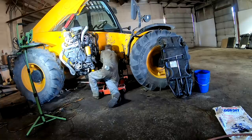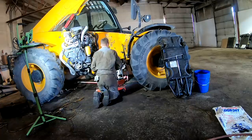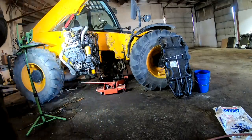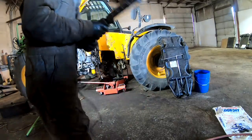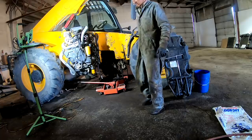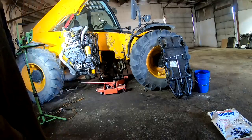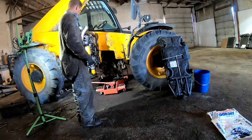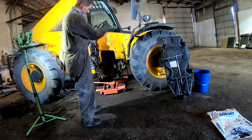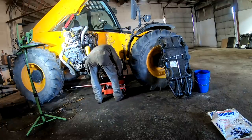Okay, she's down on the ground. Might have to come along that sucker out of there, because this jack don't work for shit on this rough old asphalt floor in this old potato cellar. It's almost like being out in the gravel trying to roll a floor jack on it. I think what I'm going to do, now that I've actually got some money, I'm gonna go buy a piece of 3/16 4x8 sheet of plate. And when I'm ready for the jack part of the operation, I'll throw that plate down here, maybe weld some hooks or something on it where I can drag it out with a piece of chain, and put the jack on top of it. I think that'd be a smart thing to do, instead of fighting it.